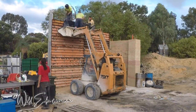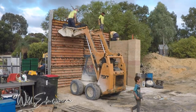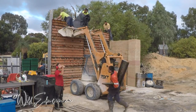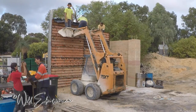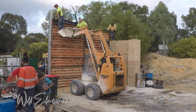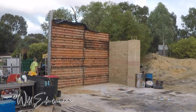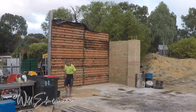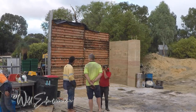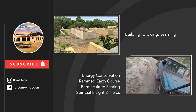They've rammed it to where they need to, and now because it's about to rain they're putting on some black plastic — the mud hasn't set at all yet so you don't want water on it. There's actually heavy rain coming this night, so we're putting some wood and F-clamps to hold the wood, formwork, and black plastic in place. That's pretty much it apart from tools away and cleaning — he's gone off to clean the bobcat; get as much mud off as you can. When the rain comes, the feeling now is amazing. Fantastic guys — hope you enjoyed; we'll see you next time for the unveiling of this very section.